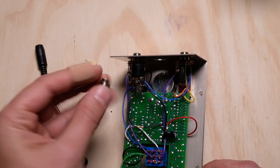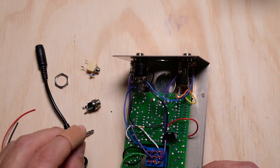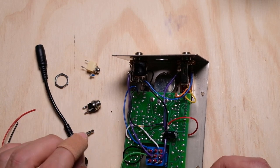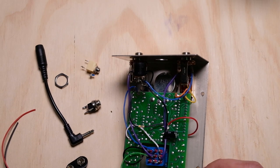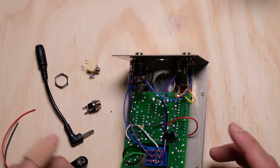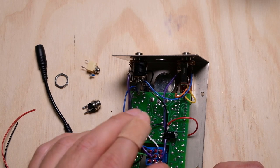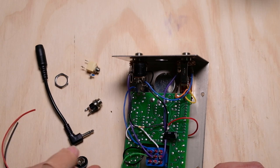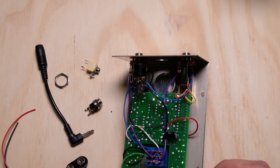When trying to figure out the fix, I knew the problem — I had to get a plastic barrel connector. I was reading up on it and it turns out the vast majority of all the pedal DIY guys use plastic barrel connectors to start with. Sure enough, when I went back to the shelf and looked at every single pedal I had, every single one has a plastic barrel connector on it. Future note: always go with the plastic barrel — can't go wrong. So I took the metal one off, put the plastic one on, tested it, worked fine. Assembled the pedal, put it on the board, tested it — still worked fine. As far as I'm concerned, this is working for me.